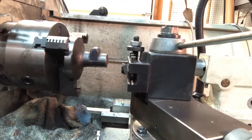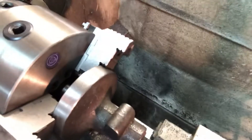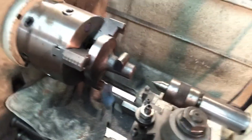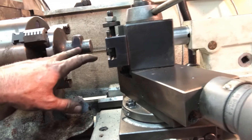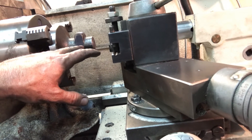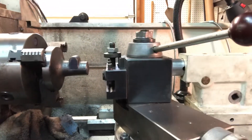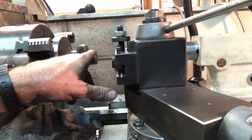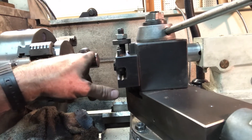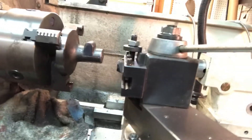I'll probably try to do that tonight and then come back and bore the hole later — I'll definitely keep you posted. As you can see, I didn't use the little three-quarter-inch tail, so I may just go ahead and cut that off. But there's no sense cutting it off until I take this thing over to the mill and measure my offset — I'm just going to go with the dimension in the book that they used for all the other three-quarter-inch clamp pads. I'll also need to mark, once I have that dimension, the exact distance to drill a hole for a one-sixteenth-inch pin that will go into the clamp pad and keep it from rotating. I hope that makes sense — let me know if you have any questions.